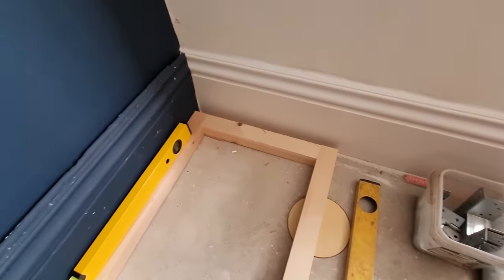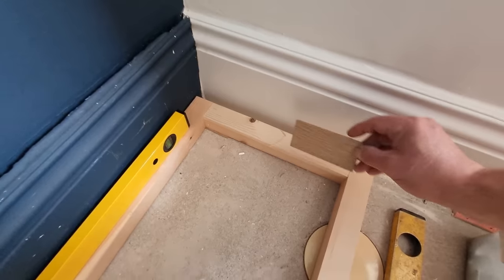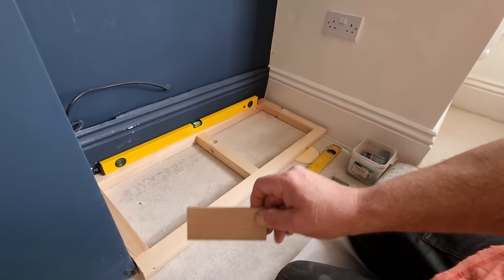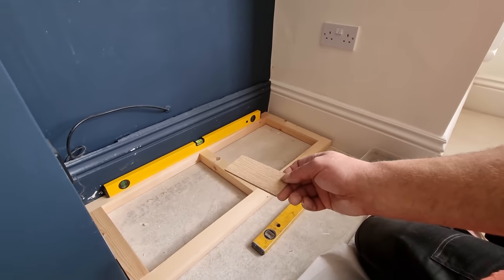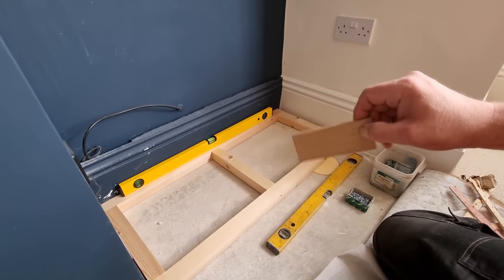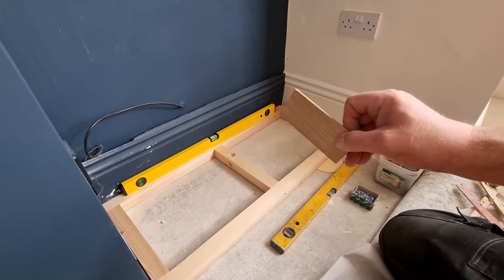Right, you see me packer. That goes across the joint like that. So both that piece and that piece is supported. So when I come to do these ones, I'll do the same like that. And I've only put one screw in, because by the time all the weights on it, they're not going to go anywhere. And because I cut these all parallel, all the same, it should be parallel, square, all that sort of thing. If this one was slightly longer than that one, then it'd be out of square.